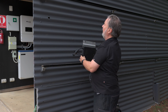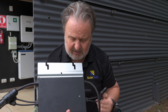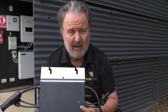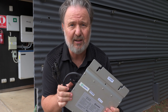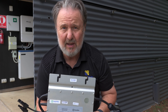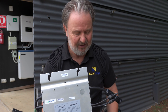Not quite sure exactly where I'll put it — probably on the rail as it's supposed to be, so that we can see the small LED on the front. This little LED is a status light, so it tells you things like: is the grid available? Is it synchronized with the grid? Is it operational? It's got a little green light when it's operational, and little red flashing lights when searching for the grid. It's a really light little unit — completely weatherproof, with an integrated antenna. It transmits to the data communication unit, which could be a long way away. In fact, I've got some modules about 30 meters and several shipping containers away, and through all that steel it's still communicating.